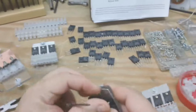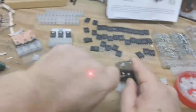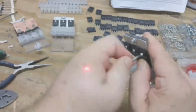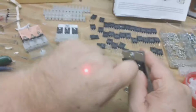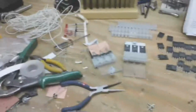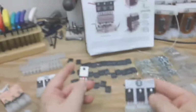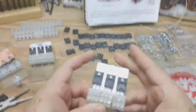So I just found these little bolts, little screws surplus, and they were just the right size. So they go all the way through the heat sink and they screw into the backing plate. Now on the bigger 250 volt version of this chip, it actually has a metal grounding to cool it better, and it also connects the actual pulse circuit to both plate surfaces. So okay, now we got that connected.